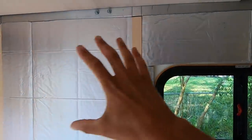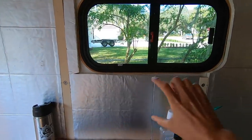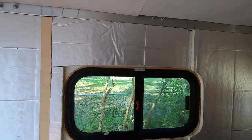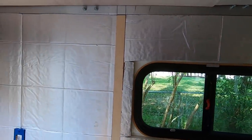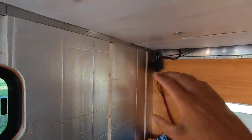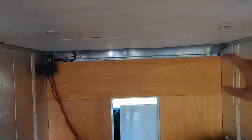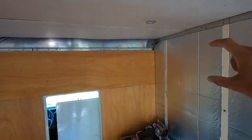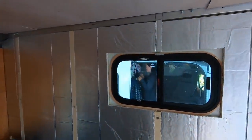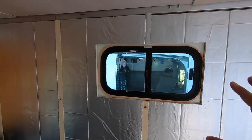I'm going to sit and map out where I think I'm going to be mounting stuff. I'm definitely going to have a spice rack or two above the stove, so there'll be a board there, maybe another shelf above the window. I'll put one there as well, and just try to strategically place them based on where I think I'm going to be attaching things. I'll be having a big shelf going all across the front, so I'll put one or two boards going horizontally there. When the paneling's up I'll have something to bite into.